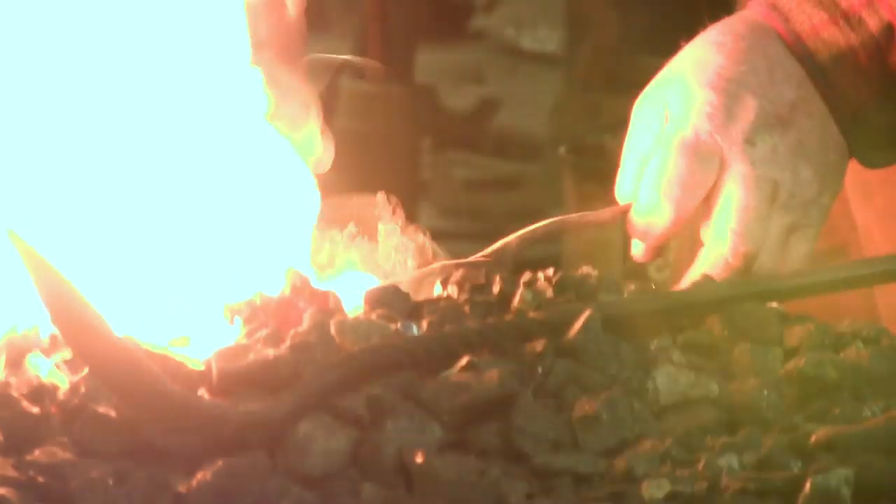But this is a little delicate with the high carbon steel. You have to be really careful because if you get it too hot, it starts to burn the carbon out of your piece. And when you pull it out, it will just crumble. So we want to watch it pretty close, and as soon as we start seeing the sparks, we'll pull it out and attempt to make the weld.